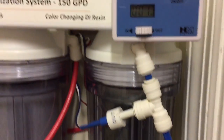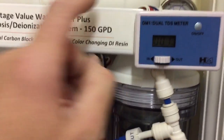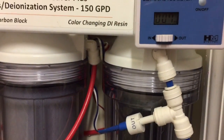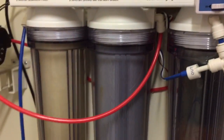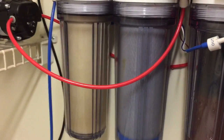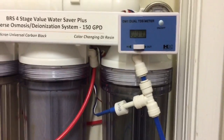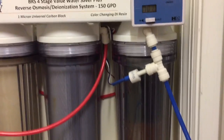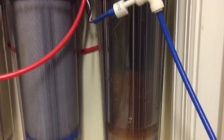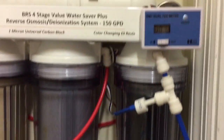It works very well. I am running at 1 part per million coming out right now. Going in I'm at 7, so I think that's pretty good — the first two filters are doing fairly well. Coming out at 1 is not a concern; typically once you get up to about 3 to 5 is when you want to look at changing your resin. You can see I'm about halfway through — about half black and half brown — so that's probably why I'm pulling a 1.